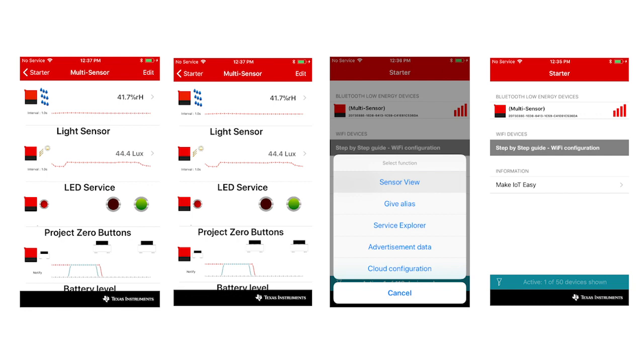Now in terms of software development, you work with the CC1352R through the SimpleLink SDK. That's how you start accessing example projects that are pre-programmed on the CC1352R LaunchPad, like a Bluetooth 5 example that pairs with an Android and iOS mobile app — the SimpleLink Starter smartphone app — that allows users to read data from sensors and push buttons, toggle LEDs, and even perform over-the-air firmware updates.